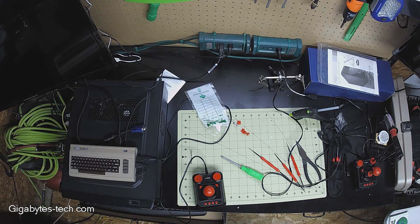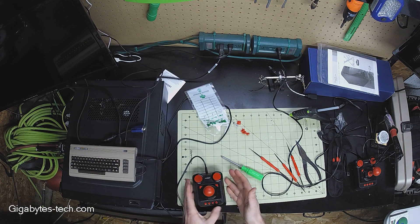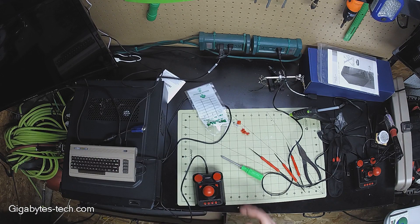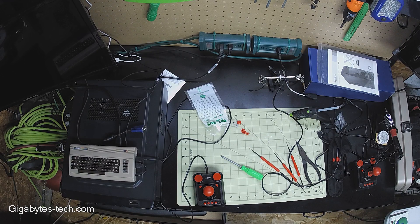Okay, now I have it reassembled, but there is a slight problem. Because I used such tall switches — I think they are 6mm or so — in some areas the switches are actually too tall for the joystick. So I've had to leave the clamshell a little bit loose. We'll see — let's just power this on and see which buttons it's pressing, if anything. Let's loosen it up to figure it out.